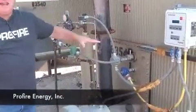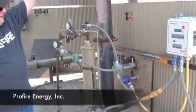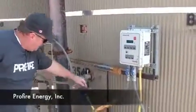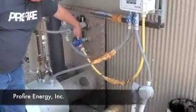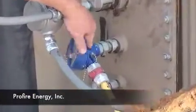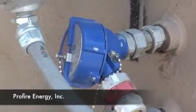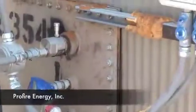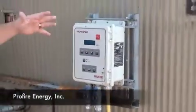You have the fire tube in the bottom of this that provides heat to heat this whole vessel, the whole tank. And this thermocouple right here is the component that measures how much heat is in there. In order for them to sell this oil, it has to be 163 degrees, so their set point in here is somewhere above 163 degrees.